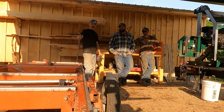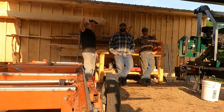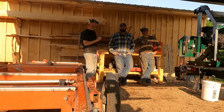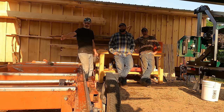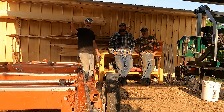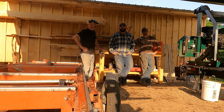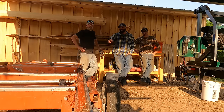So on this one, when I was cutting the standing 4x8s, they kept hitting the slanted part of that. If I went 8 1/8, I couldn't get by it. I had to go 8 inches exactly. And it would rub. I saw that. So the way you get around that is you leave a 4x4 along the edge, and you stand your piece up inside, and then you can go 11 inches high. So that's called the throat, right? Yeah, but that slanted part, that's a pain in the butt. That's why Woodmizer doesn't do something to move the engine over just a hair, or I don't know.